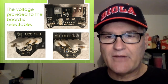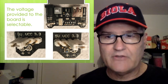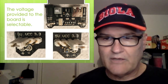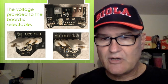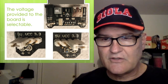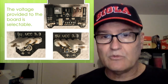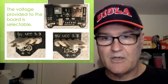Something important to understand about this power supply module is that the voltages it provides are selectable. You can see the suitcase jumpers — the one on the left connects 5 volts to VCC, and if you move it, the one on the right connects 3.3 volts to VCC. Depending on how you configure those jumpers, the module puts either 3.3 volts or 5 volts onto the protoboard.